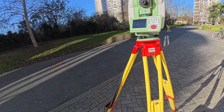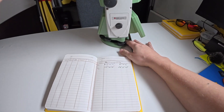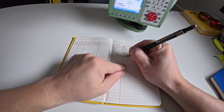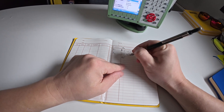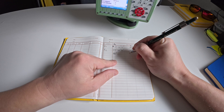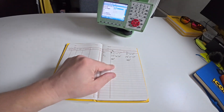That would be the procedure for checking on site. Just keep having a look at the ITP and speak with your senior engineer. Let's go to the office and I'll show you — you can do it easily on the calculator. On screen you can see horizontal, vertical, and then we change the face and take the reading to compare. The horizontal angle should be 180 degrees when we take the first reading from the second one, and any discrepancy will be double our error. For the vertical circle check that should be 360 degrees — we add the numbers, and the discrepancy will be double our error.